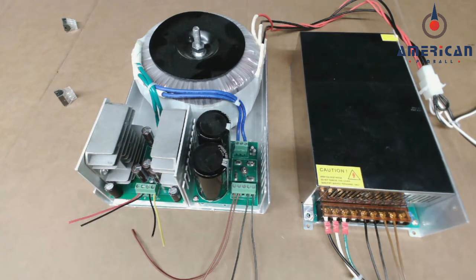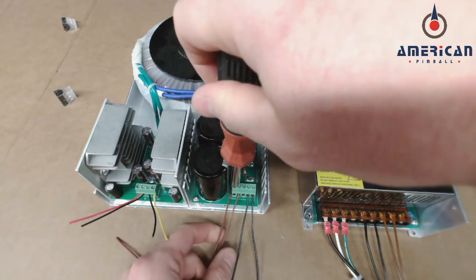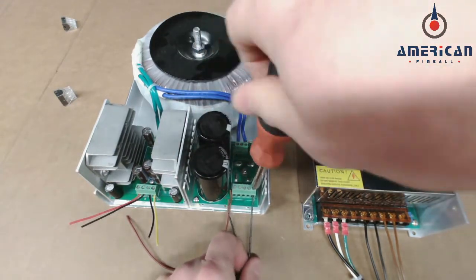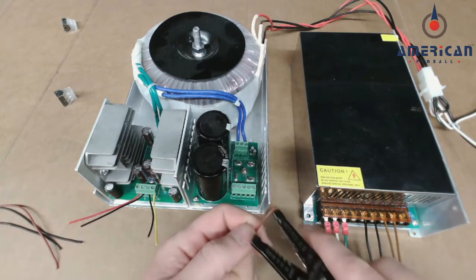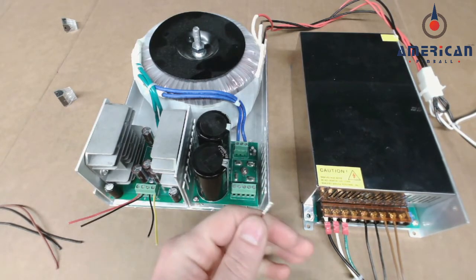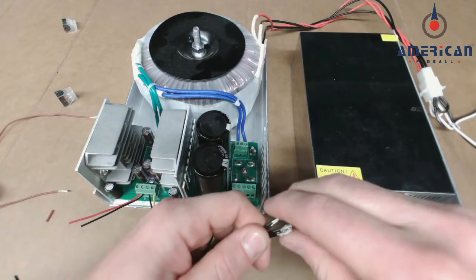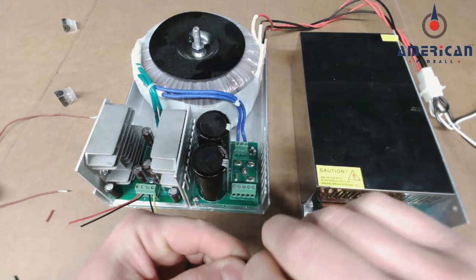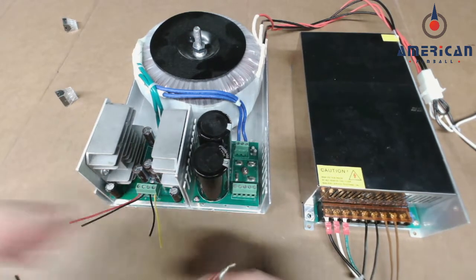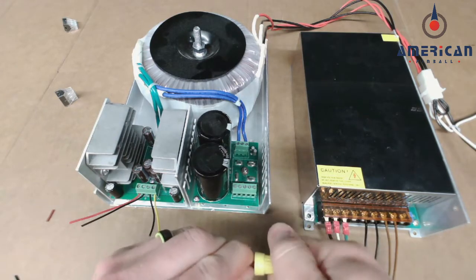This is a demonstration on the bench. Disconnect the connections on the original power supply. If you need more wire, use wire strippers and remove about half an inch of insulation from the black and brown wires so you have enough to twist them together. Take all your black wires and twist those together. Take all your brown wires and twist those together. Then take a wire nut and screw it onto both the black and the brown sets of wires.